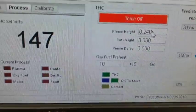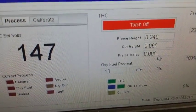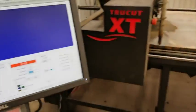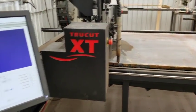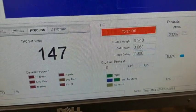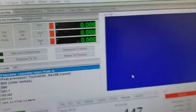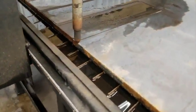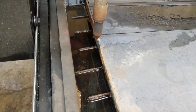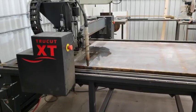So you'll notice here it does not populate the pierce delay because I have it set for one inch. The three-quarter inch pierce delay with an 85-amp tip is 1.5 seconds, so I'm going to make it two seconds on the pierce delay. We're zeroed out here and down to a good spot. Once you start this, your machine can't move. We've got it set up for edge start on an outside contour — might as well only pierce when we need to.